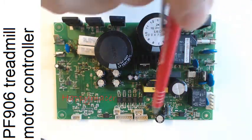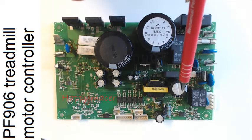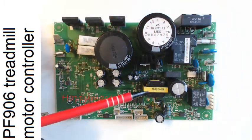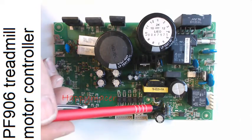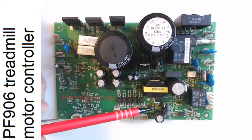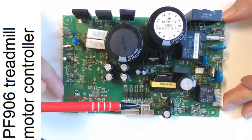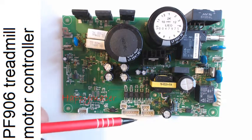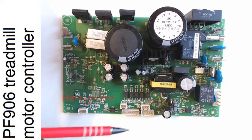This switch mode power supply is directly connected to the AC mains. It has its own bridge rectifier, smoothing capacitor, switch mode power supply controller, and transformer. The transformer has two outputs. One set comes through these diodes here and the other set through these two wires onto this diode. The supply on that side has an output of about 12 to 14 volts, and it provides that via these two pins — VCC and zero — to the control board.